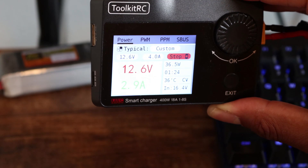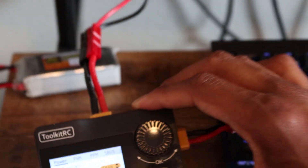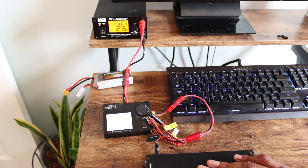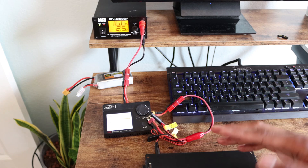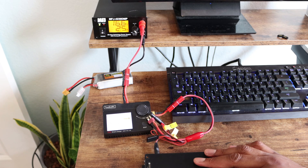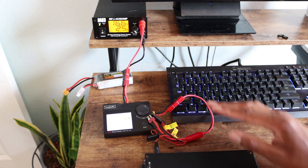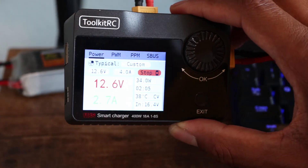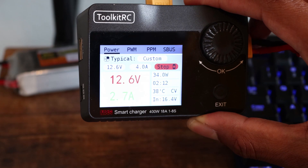You can go as low as half an amp — I pretty much stop somewhere below half an amp, that's enough. And then if this was plugged up to the battery, I could check to see what the voltage is. Remember, maximum voltage is 12.6 volts. I believe I had this one at a storage charge around 11 volts or so, since this is unit one that will be going to whoever the first buyer is. So I will not fully charge this battery pack. You can see it's slowly dropping: 2.7 amps, 2.6 amps. When this gets down to half an amp or lower, you can say that the battery pack is fully charged.